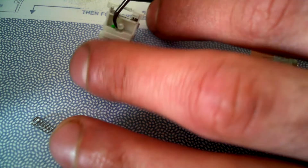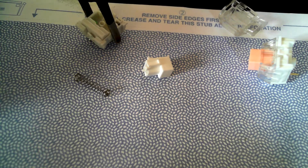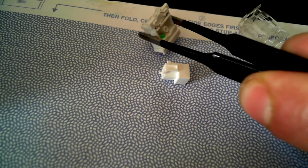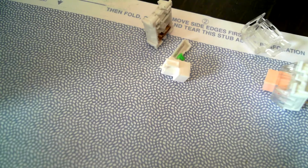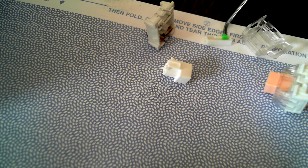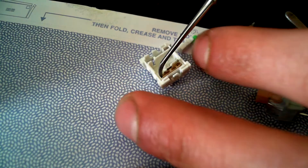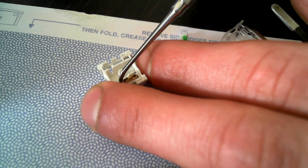That presses down on this — let me see if I can get it on video. There we go. That actually presses this thing down. The next thing I was gonna do is open it up. This is what actually activates the switch — it's got this little piece of rubber, and when the switch goes down and this thing pushes that in, it actually presses the contact leaf and activates the switch. Yeah, you can see it there.